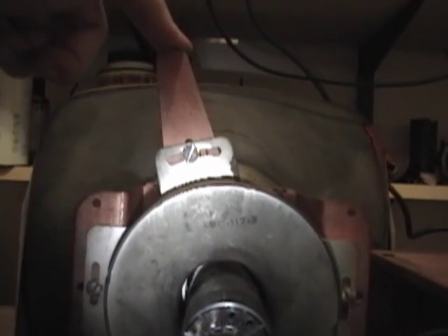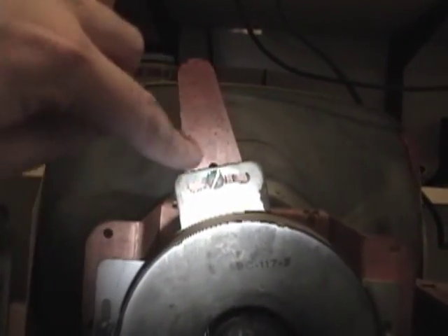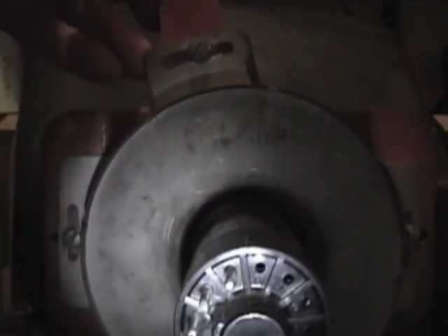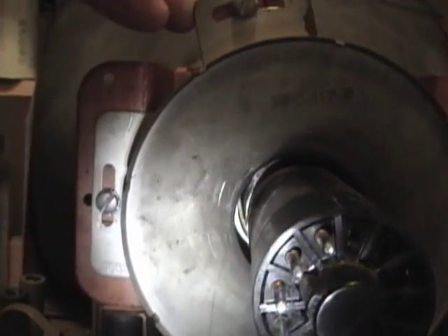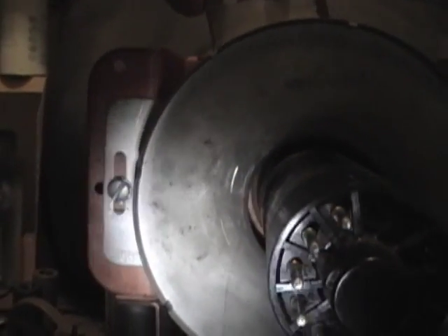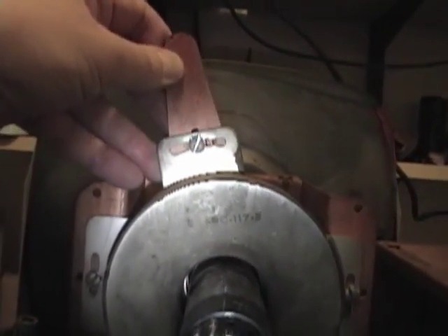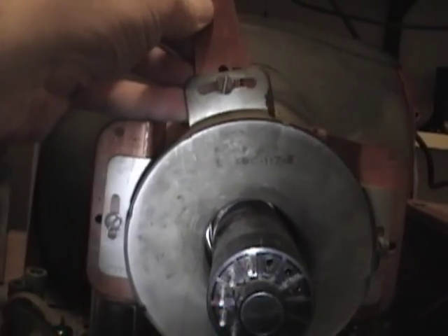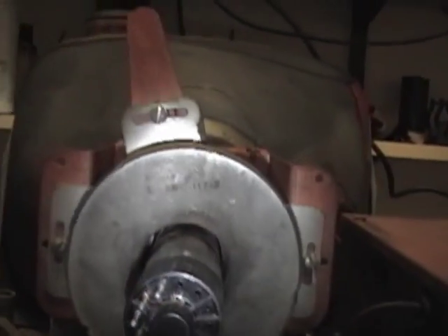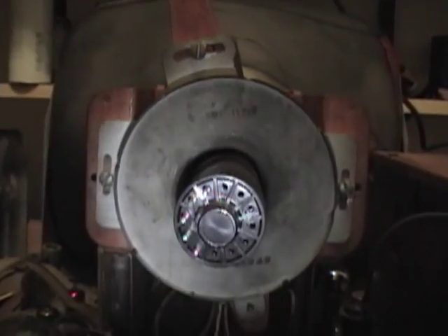And this is the center ring control. It's got a pivot point down here and one up here. I loosen this up and now you can go left and right, which moves a piece of metal inside there, and that has a subtle effect on the electromagnet — it'll kind of skew the electron beam left, right, up, or down. So you can move this left and right and also up and down a little bit. You don't want to do it too hard — hear that little clink? That's that metal actually hitting the neck of the picture tube. So you don't want to whack this over or you could shatter it. Move it a little bit and it has a significant effect on the picture.